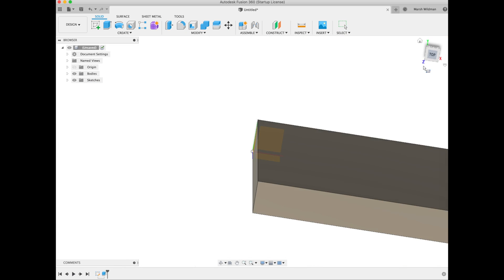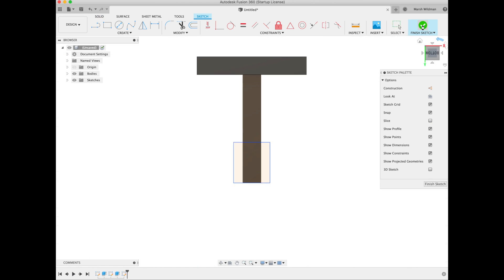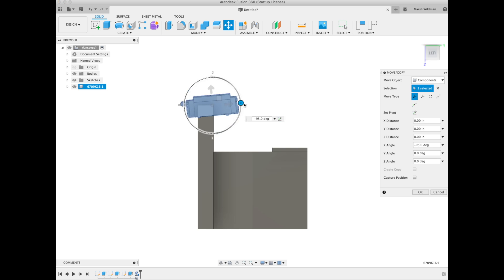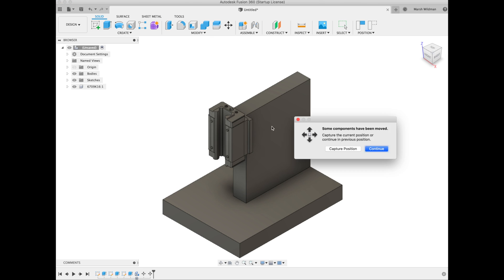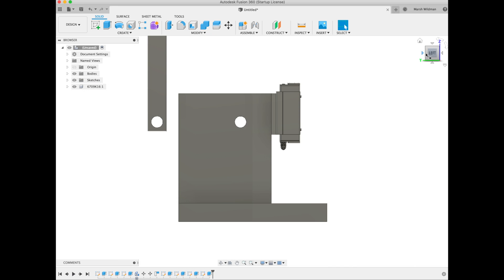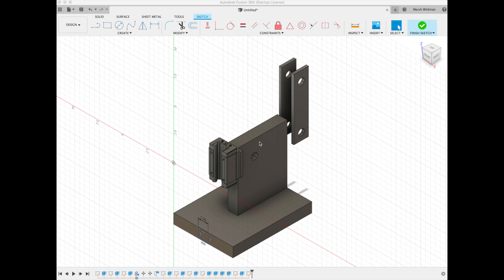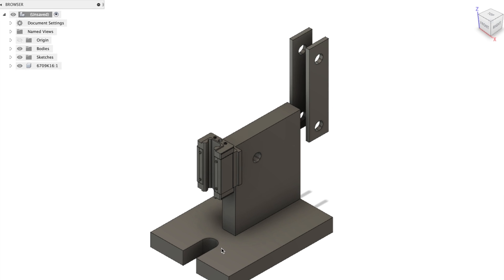One of the first things I want to do is create a CAD model so I have an idea of what I want to build. I know I wanted a mounting perch for the bearing, a base, and a tower. We can go to McMaster-Carr and import the CAD model of the bearing and bring it into our model to give us a better idea of what this thing's supposed to look like. We're also going to need to punch a couple of holes in it, create a couple of fulcrum rods that we can pry against with whatever lever we come up with, and ultimately put a hole in the base so there's a place for the punched-out piece to drop.